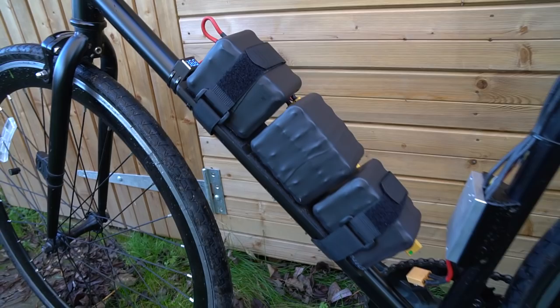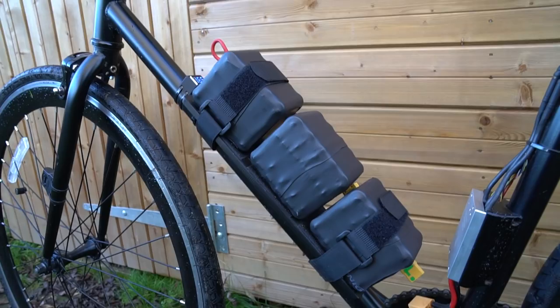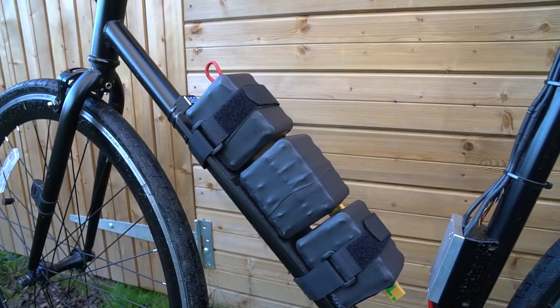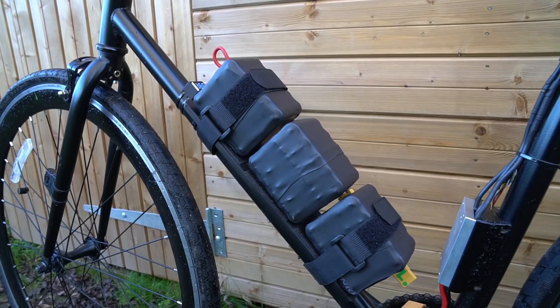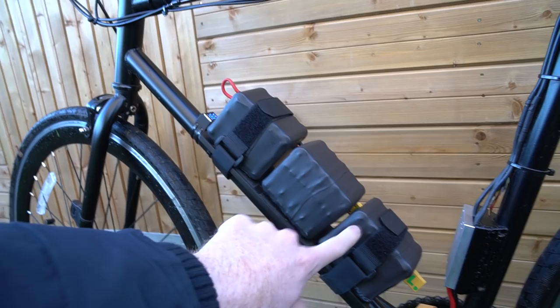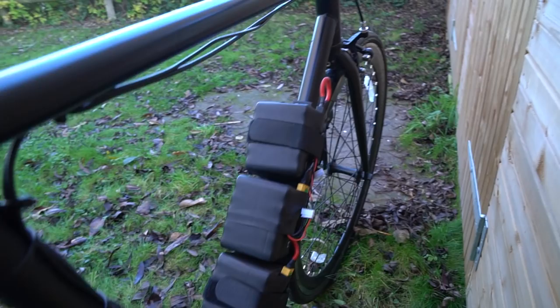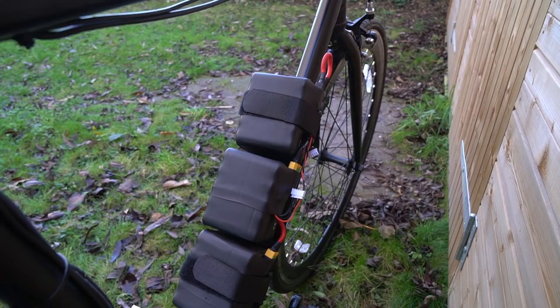Here is the new battery pack - lots of 18650 LG HG2 cells. It's a 12S5P rated pack, so that means it's about 40 to 50 volts and about 15 amp hours. Each of these are 4S5P so I can use them for other stuff - they're slightly low voltage each pack and wired in series. I've wired them up in a way that I don't need to have a massive lead going to each battery; it's all connected in series down to the main plug at the bottom.